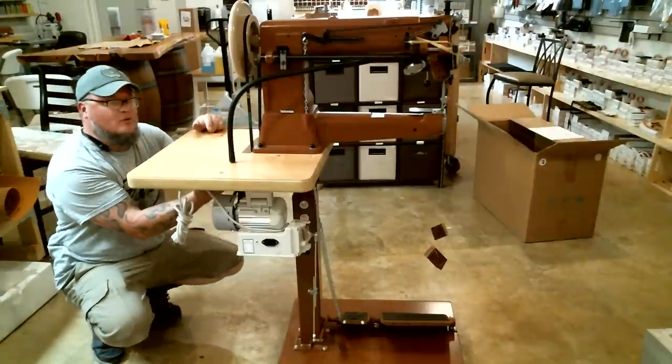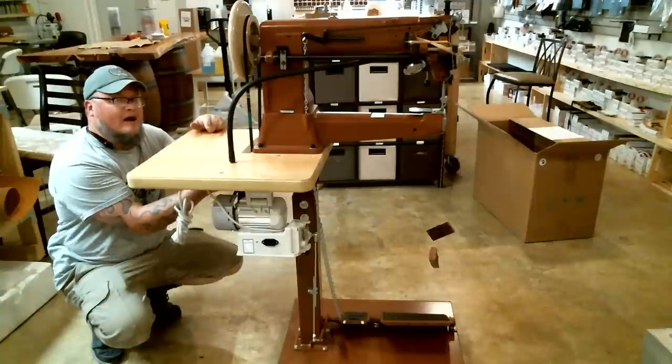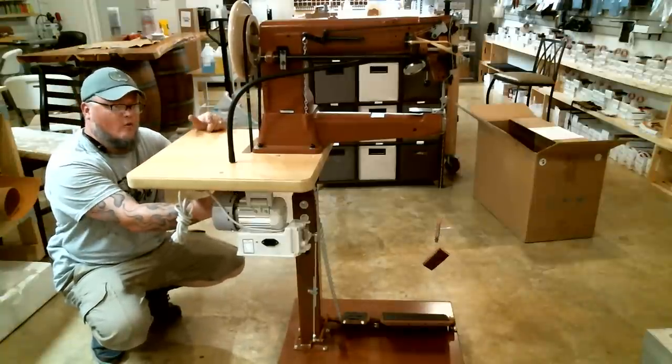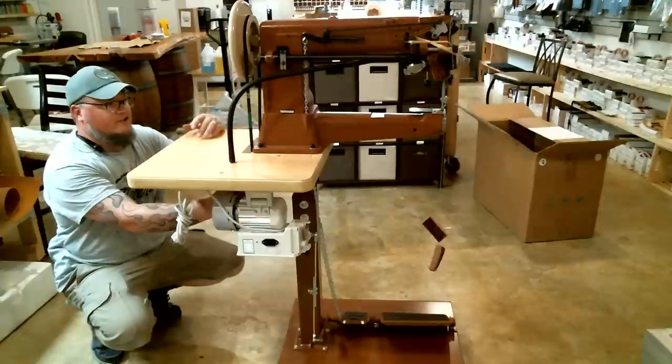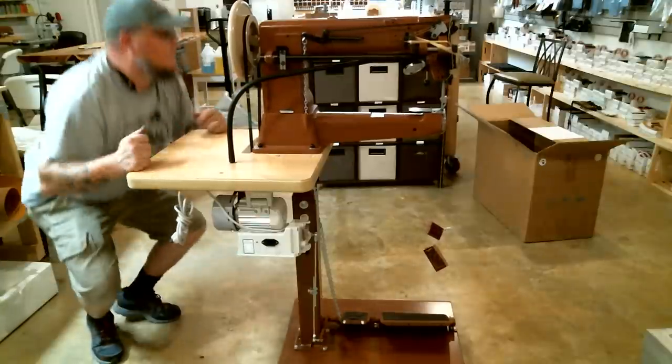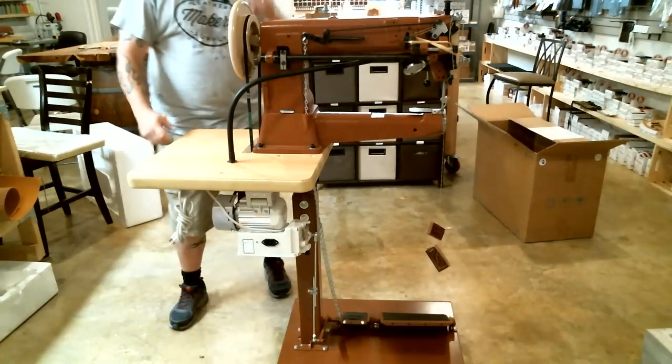Your big thing is you want to make sure when you're wrapping it around the wiring down here that you don't get it against the hand wheel or the belt, because that'll create wear, that'll wear a hole in the electrical line, then you'll get a short, and then you're going to have a fire. Nobody likes a fire, especially not in their leather room.